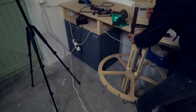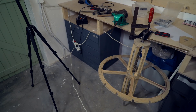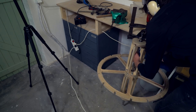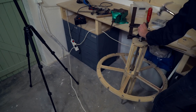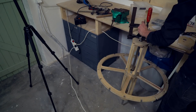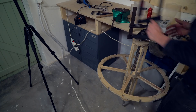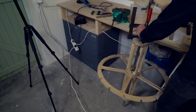The real stupidity here was not that I made a mistake, but that I tried to dig myself out of the hole by continuing to hit on the end of that shaft. The mushrooming effect that makes the end expand in diameter just kept getting worse and worse. What I'm basically doing is riveting together the two pieces that I want to separate — the harder I tried to hammer on the end, the more riveted together the two pieces became. I just wasn't thinking; I wanted to take what I thought was the fast way out, and I got punished.